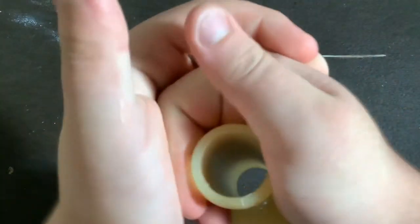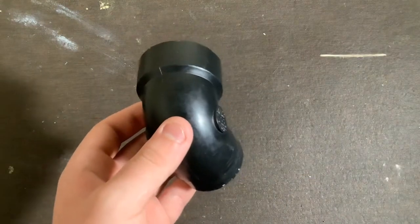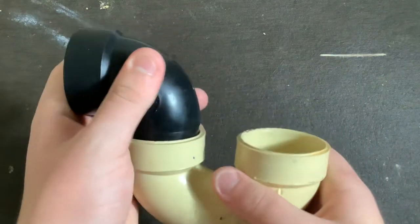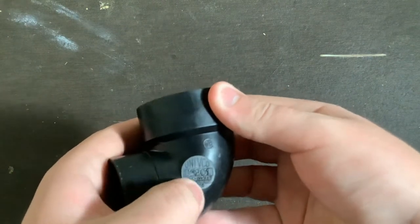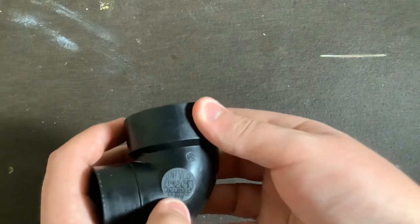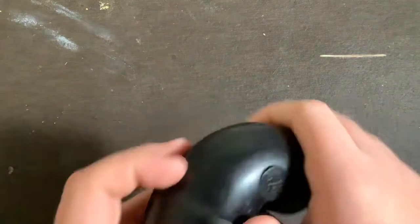This fitting is flexible so it can't be brittle. The next fitting is a Univco ABS fitting — you can see that's the Univco logo right there. It's from the 70s and it's just a wall trap elbow. You glue this onto the wall pipe and then glue your ABS 90 bend onto that. It says Univco, NSF DWV — NSF the newer way, so this fitting is probably from the 70s. ABS, Los Angeles, California, UPC. One side accepts the pipe, and the other side accepts the fitting.